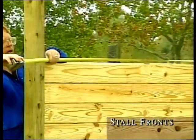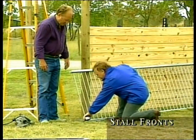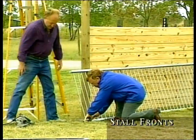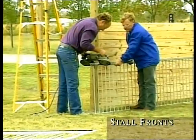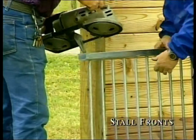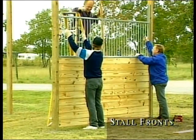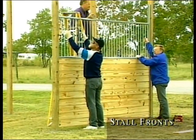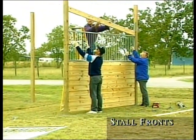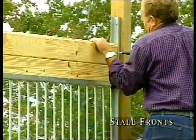At this point, measure the distance between the two legs of the channel and compare it to the length of the grill. Often in a pole barn, the width between the posts will vary, so it might be necessary to trim the grill channel to fit. You can use a simple hacksaw or a power hacksaw to cut the channel to length. Once it fits, install the grill over the 10th board, then place a board into the top channel of the grill, locking the grill in place.